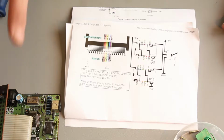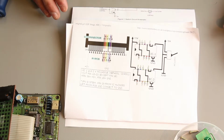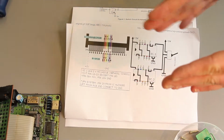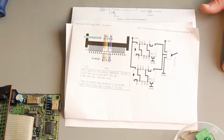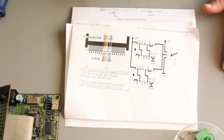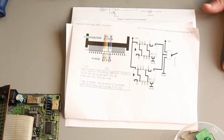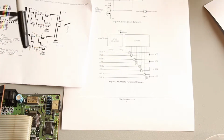What you could do, if you just wanted to mod it to permanently be TurboGrafx, is just cut the pins and then cross connect them. But what we're going to be doing is putting in 2 digital switches that will take each pair of pins and swap it over. That's the circuit diagram here of what we need to build, and I've already built it, and I'll be showing you that in a minute and how it works. Then you switch between the 2 positions. In position 1, it's a straight flow through as it originally worked, and in position 2, it maps pins over to where they should be. This will be linked in the description, along with a link to the website where I found this information. Escapes my mind what it's called right now.